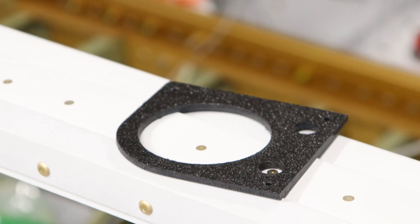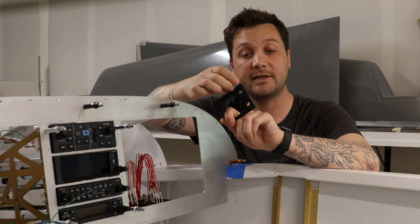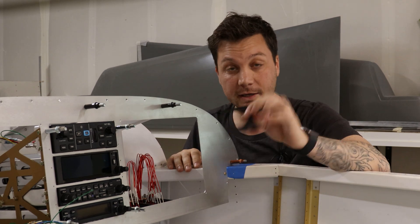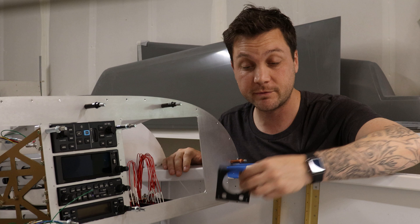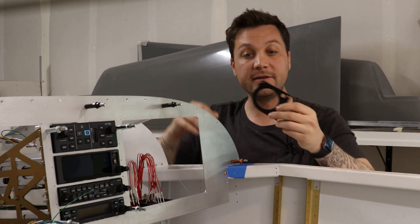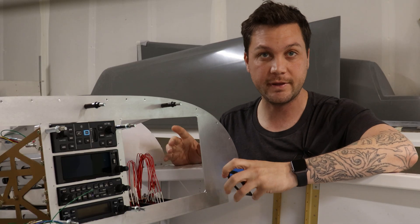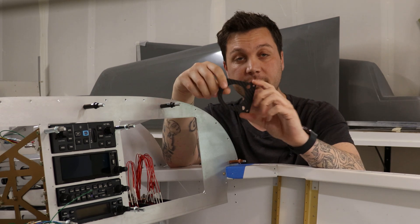You may have seen in the past I've been working on a prototype piece cut from eighth-inch ABS. It largely matches the final file I'm going to use for the vent mount, and it also includes a spot for both the headset jack and the microphone jack. Really tight, but I thought it was important to push these as far to the cabin wall as I could and not include them anywhere on the panel itself. I liked how they worked and their size. The only thing left was to generate a file — which I've done — send it over to SendCutSend, and get them cut on something nicer than ABS. Enter these. These are fantastic. I cut them from carbon fiber. I'm not going to have a lot of carbon fiber on the plane, but I do think it works great as a very small, light accent. This is what's going to hold the vent, and this is what the two jacks will mount to.